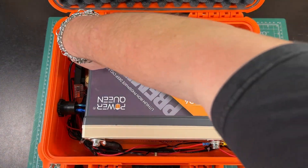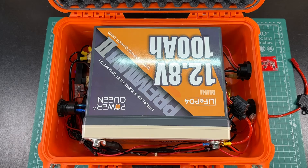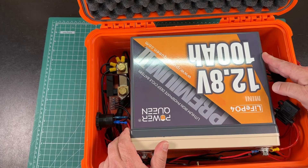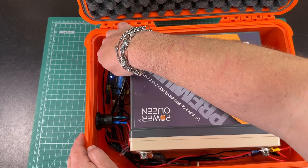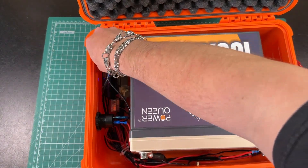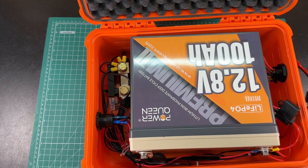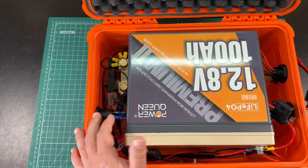Where's the voltmeter? It's right there on a tablet or on my phone filming right now. This TBD Bluetooth smart shunt — all the negatives go through there. I used an oversized two-gauge wire for the negative since all the negatives are going through it. I ran out of bigger ring terminals so I just grabbed a spare wire and made it happen. I'm planning to glue the shunt to the side of the battery, but I haven't yet because I went to buy another one on Amazon and they're sold out — even on their own website.